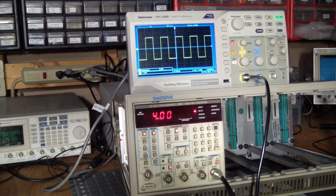And you can hear the relays click because they route a lot of signals. Instead of having a single DAC converter, they actually switch on a different quadrant of the part that generates the output. Also, in the beginning, you may have noticed a whole bunch of relays click. So yeah, they use a relay for routing signals a lot in this.